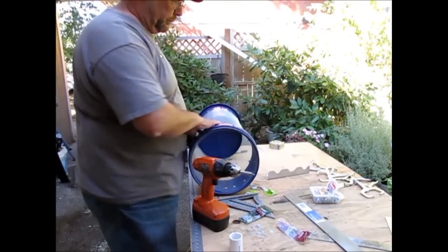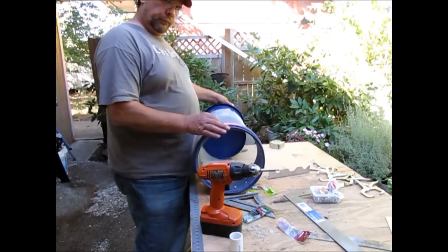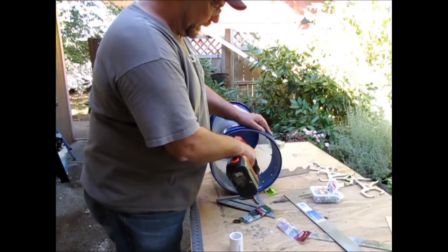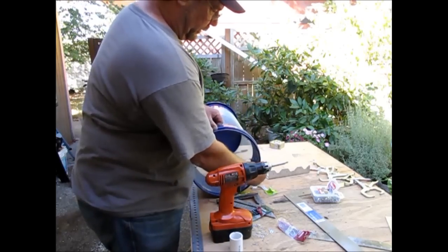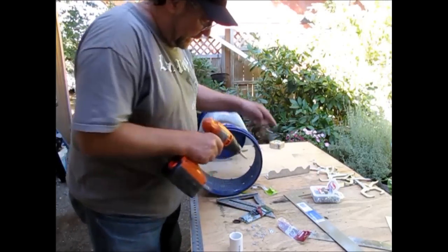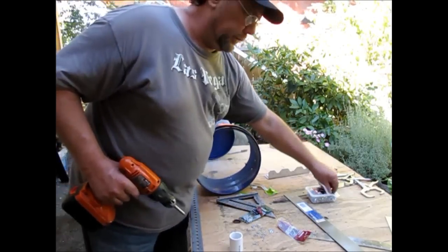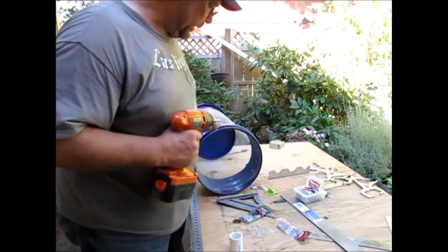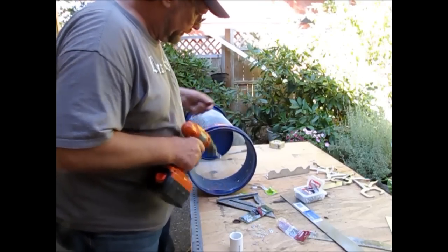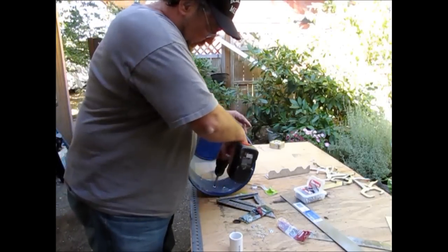Now that I've got all eight bolts, nuts, washers, and machine screws all the way around, I'm going to go ahead and from inside screw back through my mesh where this rib is about every two inches with one of my self-tapping screws. I made that line at two inches before I put this all in, and that gives me a point to put these screws behind the rib but going back through my hardware cloth wire mesh, just anchoring it down about every two inches. The reason I'm doing this is because this end is only going to be supported by those exterior casters so my spray bar can fit inside — if I had struts coming from the axle they would encumber my spray bar.